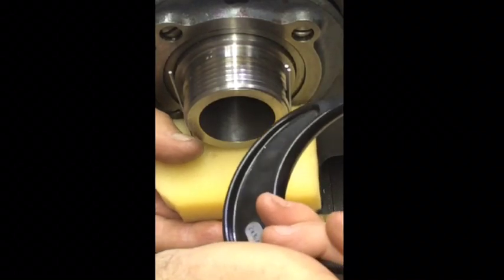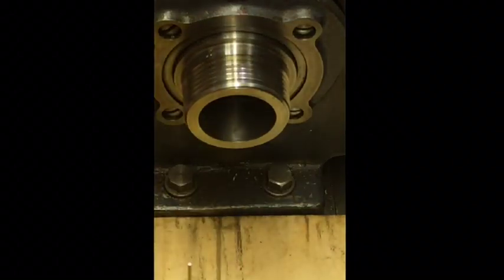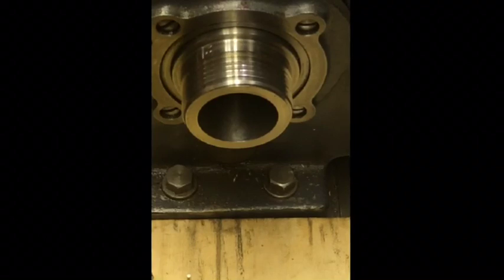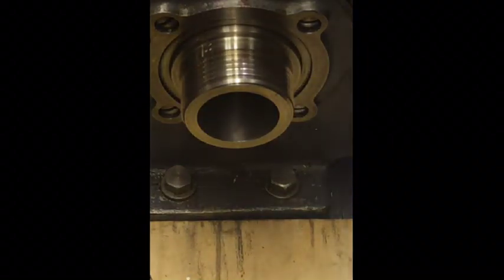Okay, I'm at 2.271, and calculating that out, use a little chart that comes with the pins. I used 0.072 pins for 8 TPI, I have a constant of 0.10775, subtract that from my reading, and I get 2.16325.